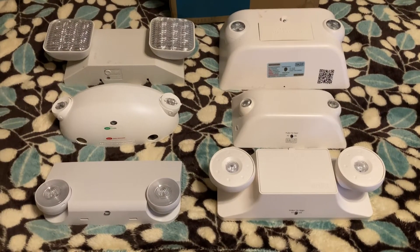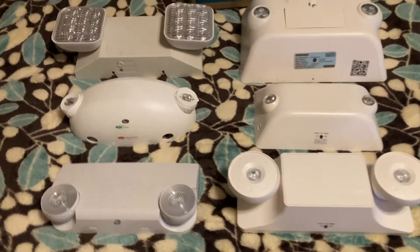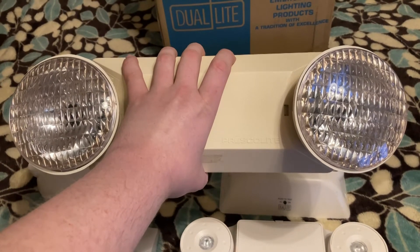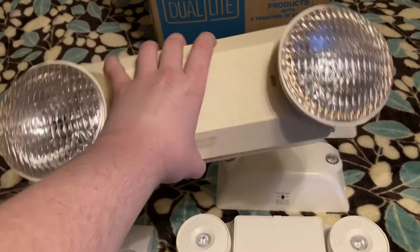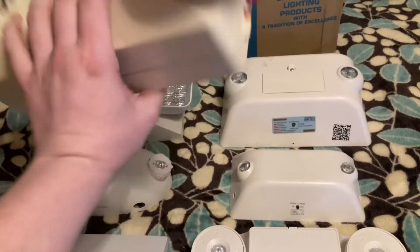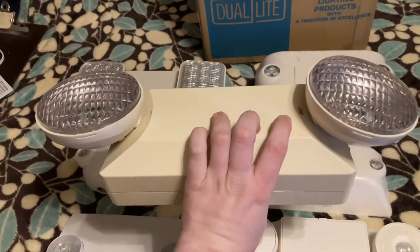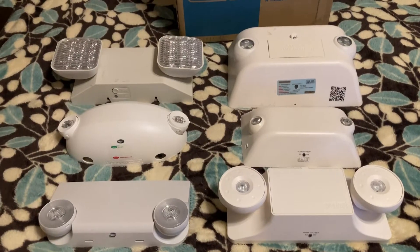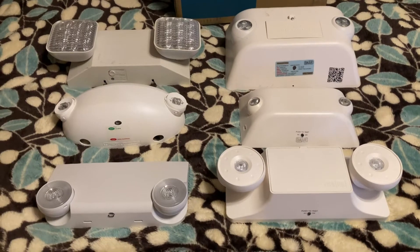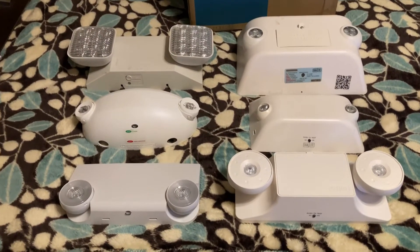Here's our showcase of emergency lighting units that you're likely to see in new and replacement installs in the modern day. As much as I really like a unit like the PrescoLite EDS-2, business owners and building owners typically don't like these anymore. They're big and bulky, they use a 6-volt, 7.2-amp-hour battery, and they're really unsightly when they get older — this one in my hand is starting to take on a yellow sheen. A lot of people don't like the yellow look and they want something more modern and streamlined. Here is the EZ-2L compared to all things Dual Light and not Dual Light.